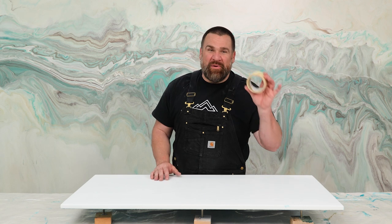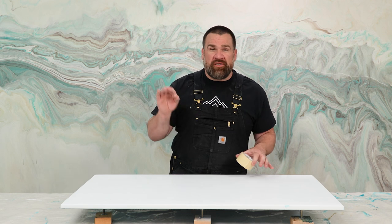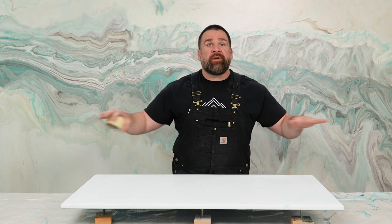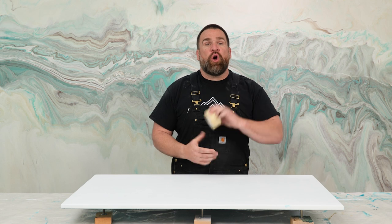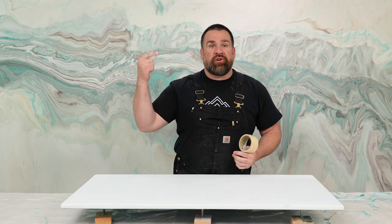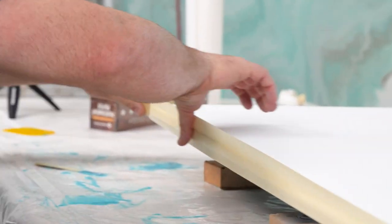The only time I build a tape dam is when I'm pouring more than 3 ounces per square foot. My clear coats, my chopped in marble, the soapstones, every time you mix up 3 ounces per square foot, no tape dam is necessary. There's been some confusion in the industry, that sometimes if you're using a 2-to-1 epoxy on your countertop, that's a thinner material, it's gonna flow off. That's where you're seeing folks tape every time they do a coat. No need when using our 1-to-1 countertop epoxy. It's a thicker material. Only tape dam when applying over 3 ounces. Your dirty pours, your melded marbles, you're gonna wanna use a tape dam.